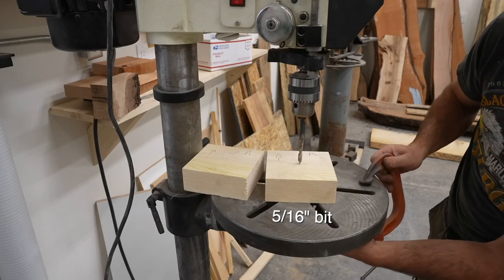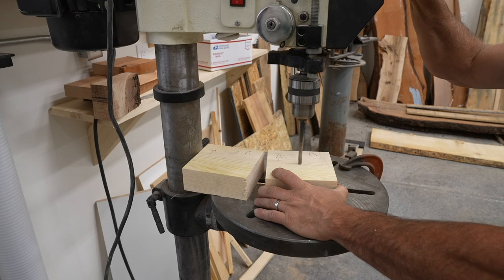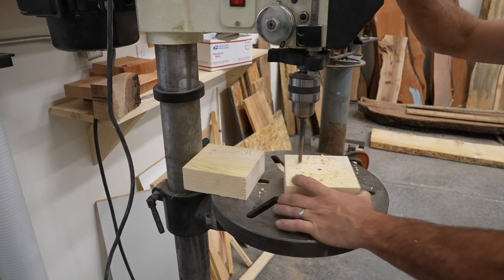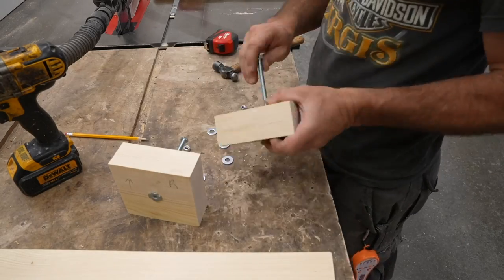The short pieces need to be a few inches larger than the largest diameter of the logs you want to cut. I found the center of my short end pieces and drilled a 5/16-inch hole in them using a drill press to keep it really straight. The vertical location of the hole has to be higher than half the diameter of your log so that the log will be suspended above. I put the T-nut in the hole on one side and screwed the bolt in from the other end.